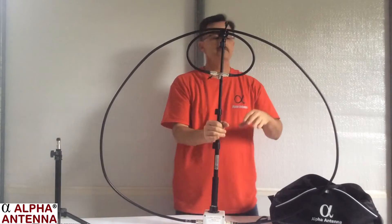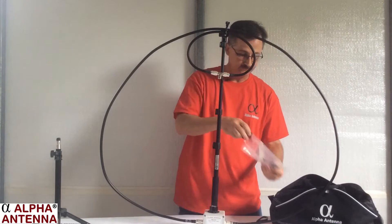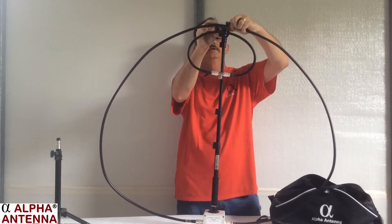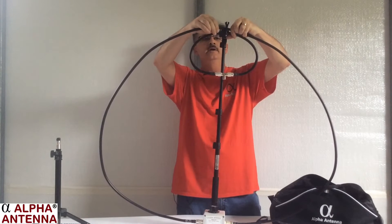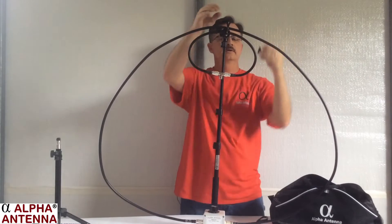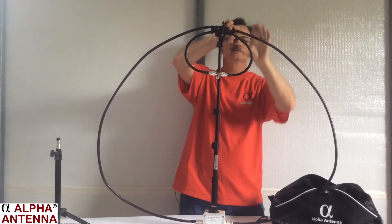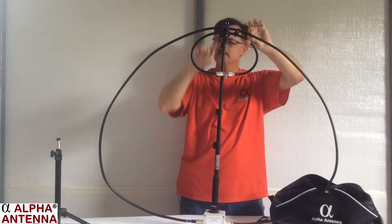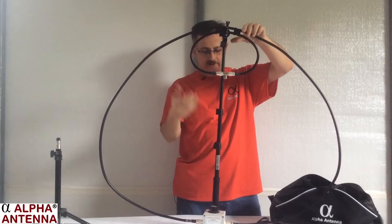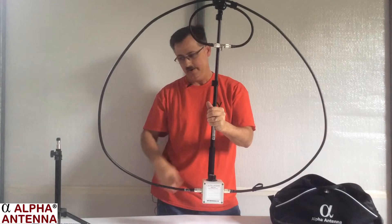Do a little more aligning if you need to. Go ahead and pull the nylon insulator out. These nylon insulators simply slide and turn and click. Turn so that it slides between the two coax. Notice how it's between — there are also close-ups in the manual. Turn it and click. Now you have assembled the 10 through 40 meter high-powered Alpha Loop.